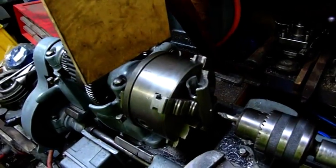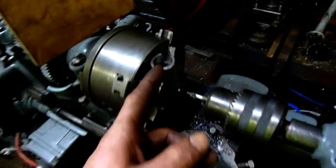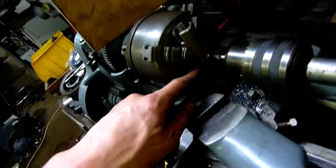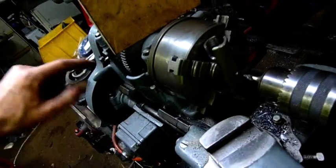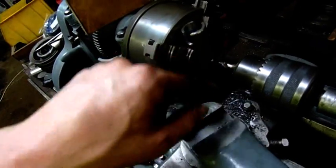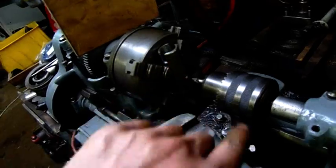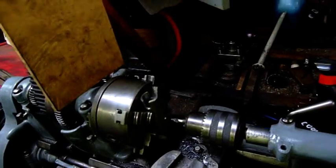I'm getting the crank starting mechanism on. I never got a crank handle with it, so let's make one up. I've taken a piece of steel tubing from a photocopier transfer drum centre spindle. I've already bored it out a bit and slotted it so that it fits over the drive pin. Now I'm doing something which I don't recommend doing with your lathe, but you can if you're desperate — and that's using a synchronous four-jaw chuck to grip the tubing lengthways. I'm going to drill a handle hole all the way through it so I can stick a piece of bar through it and weld it on as the crank handle itself. Either I cut it off short and butt-weld it, or do something a little more intricate. I'm just going to drill right through there with about a 20mm drill. I might take a bit of 20mm bar to work tomorrow and fold up a 20mm solid steel handle.